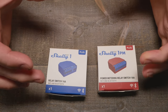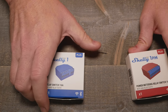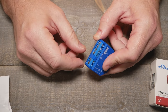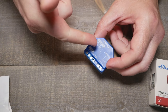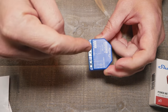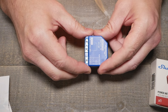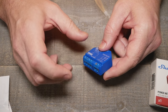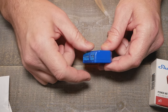Being in the US, they're not the easiest to put in the wall with thicker solid wire, but they're very versatile and stupid small. I really enjoy using the Shelly One for garage door applications because it can be powered off DC — I normally use 12-volt wall warts. You can use the reed sensor, it has a case and terminals. It's stupid simple. I've done a video on the Shelly One original with the garage door opener — link is down below.